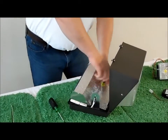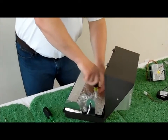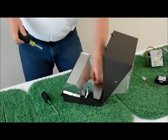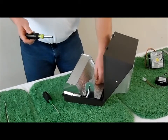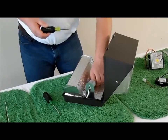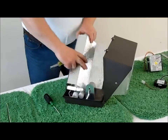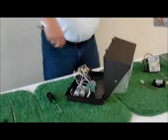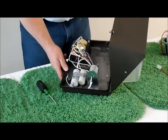The next step is to remove the reflector. We have located the reflector mount here in the center. Because every fixture is different, we are going to use this center mount to mount our 25 watt LED retrofit kit. So remove the reflector and set it aside — we will be putting that back in. Now you have the guts of the fixture.